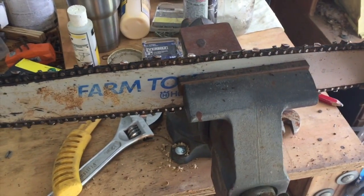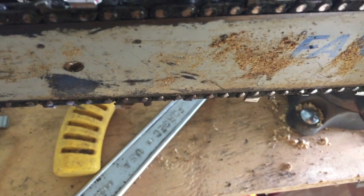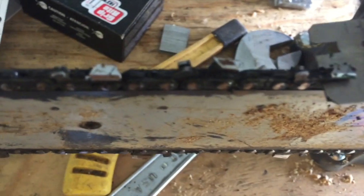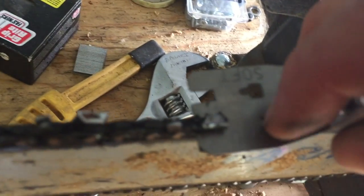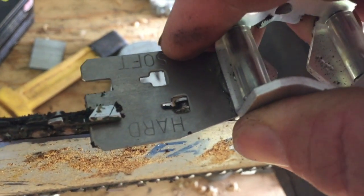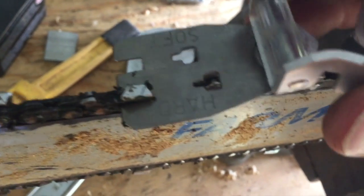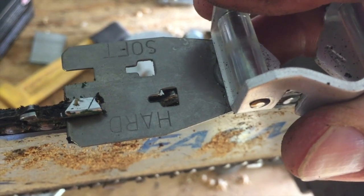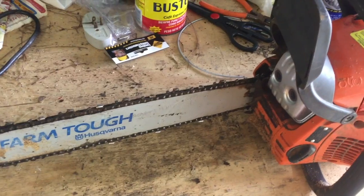We've gotten both sides now. We're going to go ahead and check the rakers. Basically with this tool, from what it looks like, you hook that tool under the tooth — for hardwood — and you want to see if the raker sticks up through that hole. I can't even get it to come through, so they don't need adjusting. But if the raker were sticking up through that hole, then you would take your flat file and come right across it. I don't even feel it at all. I'll go ahead and check these to make sure, but I don't anticipate having to adjust them this first time.